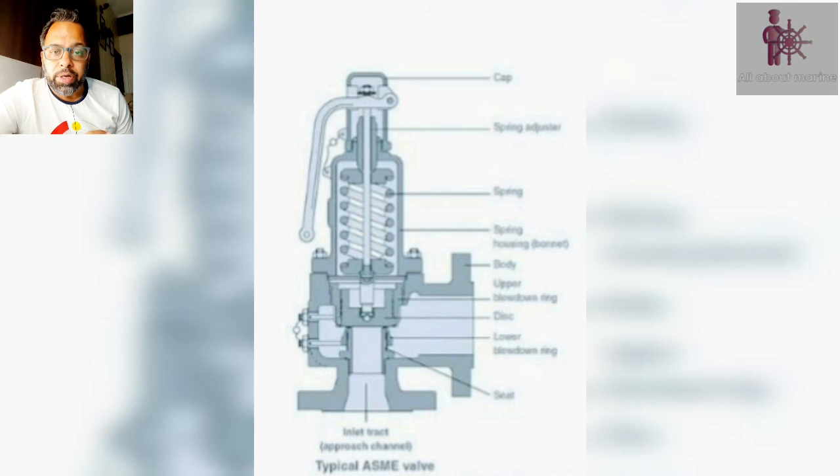This is a very very important mounting. Also we have easing gear provided on the boiler which is connected to the safety valve, which allows us to periodically open the safety valves manually so as to make sure that they are not seized or jammed because they have not been used for a long time. Please keep in mind to make use of this easing gear and lift the safety valve manually at least once a week so that if the need arises, these safety valves do work.